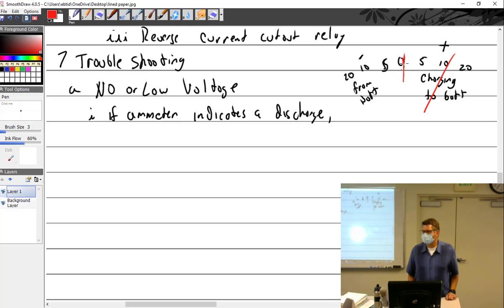I find it too, Kevin, that you showed us when we were working with our gear motors. Yeah. That when you first energize that motor, it draws more amps in the very beginning. Yeah. Which would tend to drain that battery. The starter. It's a dead short for a second. And so, yeah, it's going to come right back to 0.